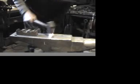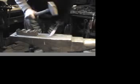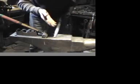Now with care, you can generate this shape on the flat portion of the anvil. But what you're doing is you're pinching the bar between two flat surfaces. This is not as effective in terms of creating a conical shape. It does allow you some control against bulges that are created as you form. You can see that now what I'm doing is taking the overall shape and evening off to a long taper.